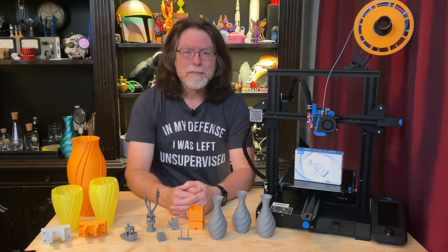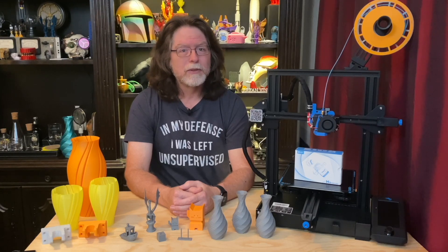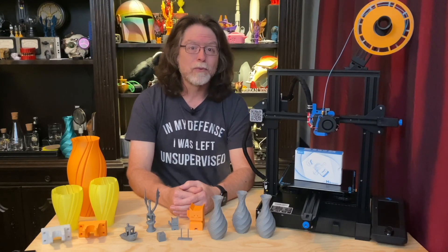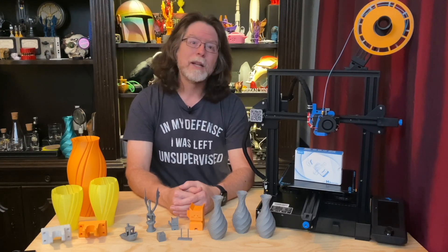There was a fair bit of connector crimping involved, and I discovered that the more you crimp, the better you get at it. It should also be noted that installing the H2 with a printable adapter plate means the nozzle is going to be somewhere between 10 and 15 millimeters forward of the bed when the y-axis is homed. It's not a huge deal, but worth mentioning. After installing the H2, you should perform a PID tuning on your printer's hot-end — the settings in your firmware are tuned for the stock hot-end, so you're very likely to see issues with the printer not being able to keep the nozzle temperature locked in.